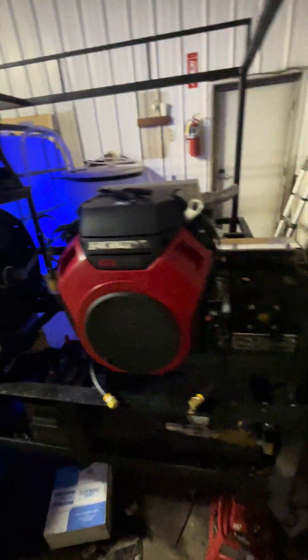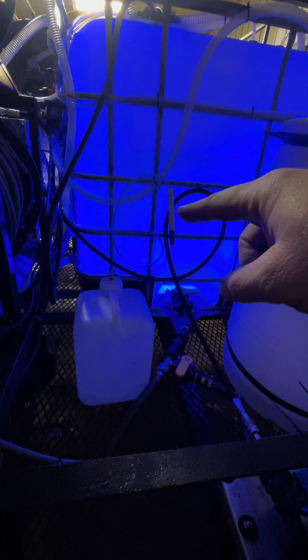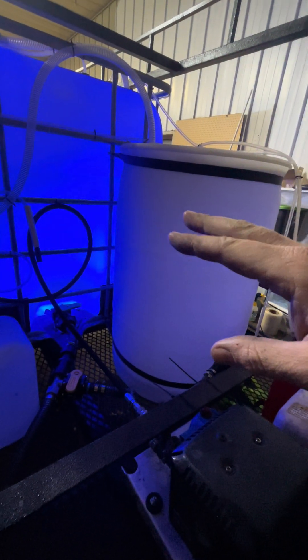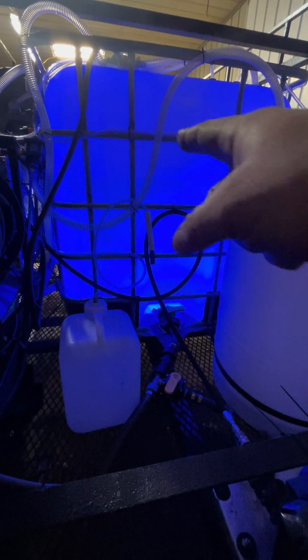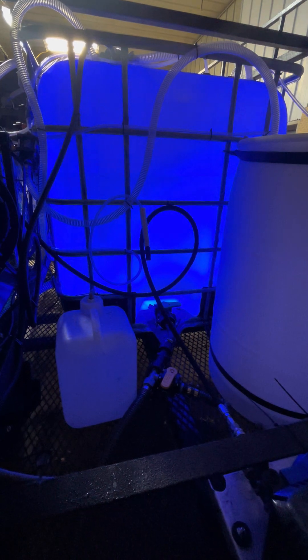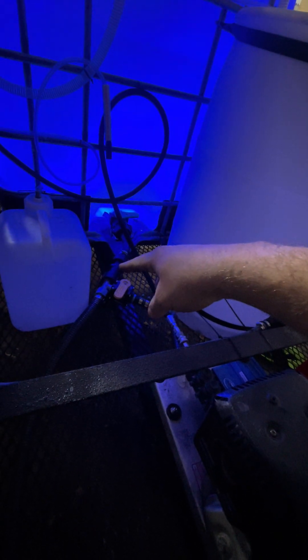I'm going to do a full tutorial over the trailer once everything's done, going over everything and why I did it. The soap line goes to a drop tube right there. Like I said, I mix my soap — I only use very, very little soap, just to get a little suds, nothing too crazy. I wanted to put a drop tube in case I wanted to put any other chemicals through the proportioner system. For the IBC plumbing to the pressure washers, I got a 2-inch banjo clip to a 1-inch barb, then to a banjo filter. The banjo filter runs to a T — 1-inch hose going to my 8-gallon-a-minute, and then a banjo valve that will run water via a 1-inch line to my 4-gallon-a-minute.